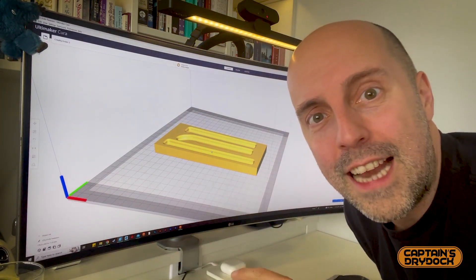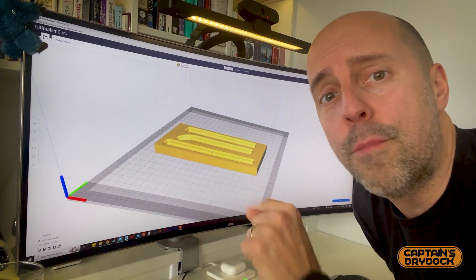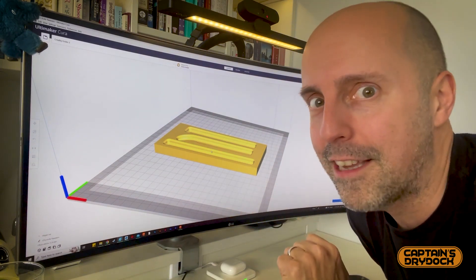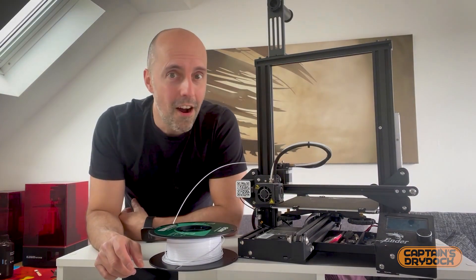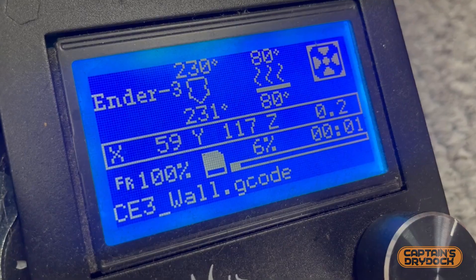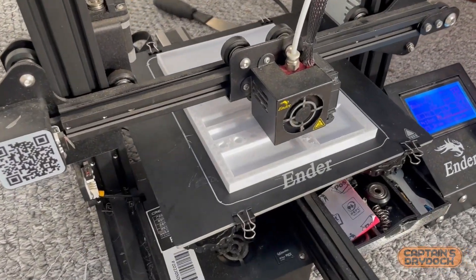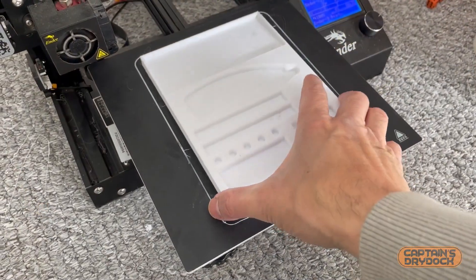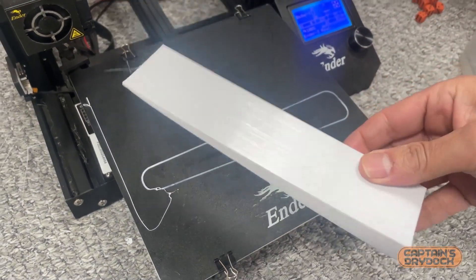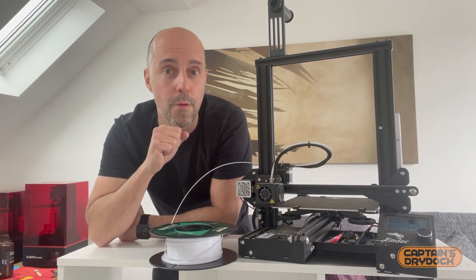The design is all done and now it's time to print. I've opened up Cura, which is the slicing software for my 3D printer, and one of the components fits on the bed very well so it can be printed in one go. For this project I'm using my Ender 3 filament printer with white filament — not just because it's a colour I like, but because it hides a multitude of sins. With filament printing you get the texture of a vinyl record from the layer lines, and it takes forever to sand and paint. White reflects light differently and looks absolutely fine straight off the printer.